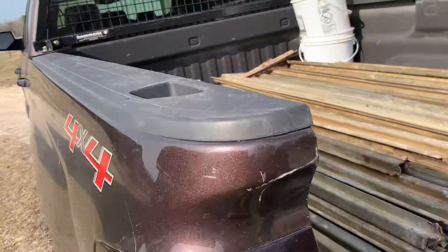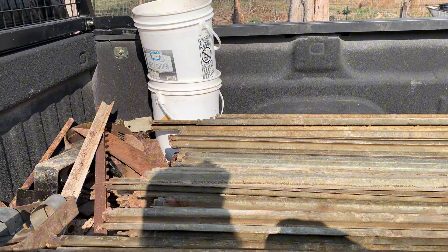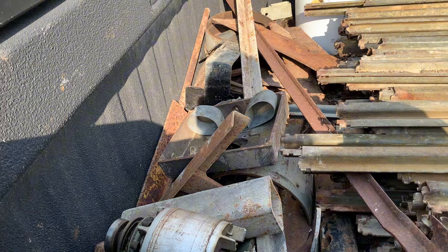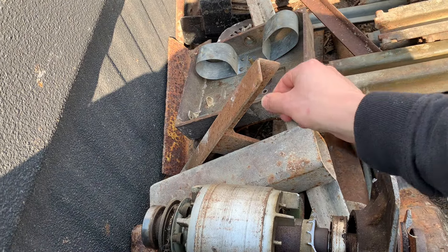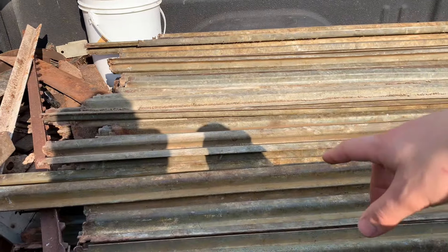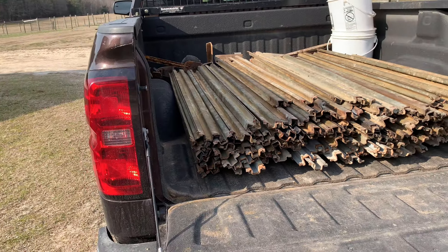Tomorrow morning I'm going to swing out early and load up all my non-ferrous — copper, brass, aluminum, stainless — all the fun stuff that'll sit in buckets on top. Then we'll head to the yard and offload. I'm hoping they can give me number one steel or prepared steel for all of this. There's no contamination, it's all steel, no plastic, no other metals, and it's all pretty thick — probably a quarter inch on most of this. For prepared steel they want it under four feet, but these are about four feet three inches — not worth my time to cut them for the slightly better rate.